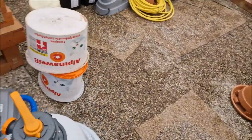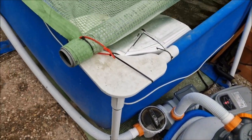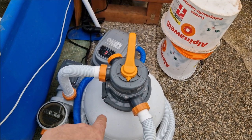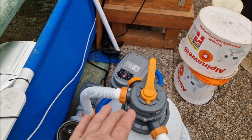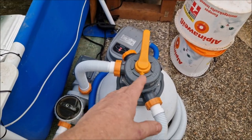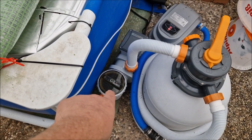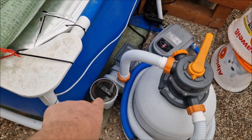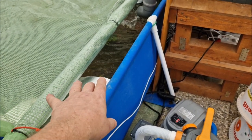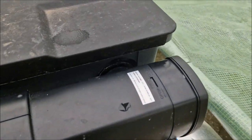Another change was my heating unit was getting clogged up, so I put in a pool sand filter and pump. Instead of sand, I bought foam filtering — coarse, medium, and fine — and I clean this about once a month. There's also a leaf-catch with a filter in it that gets cleaned twice a week on Wednesdays and Sundays. The pool gets cleaned on Wednesdays with a slight vacuum on Sundays.